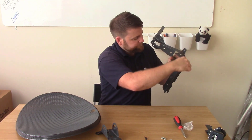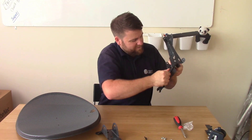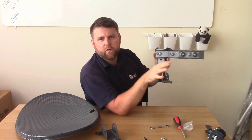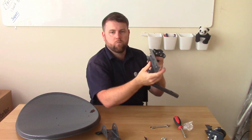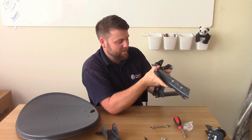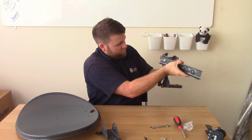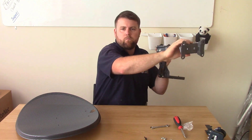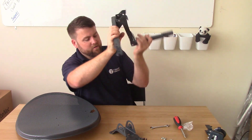And then we want to get this one tighter. Now I'm just tightening this so it's sort of perfectly straight. I'm going to get them quite tight so they're not going to move or anything. So you see it's pretty straight. If you're going onto a surface which isn't flat - so if you're going to a wall which is a bit wonky or something like that, put up by someone on a Friday afternoon or something, or on a Saturday morning when they're hungover - you have actually got a bit of movement here. So you could sort of loosen that off and take into account how out the wall is. It's not something we often do, but you can.